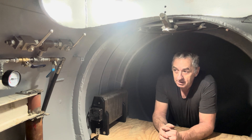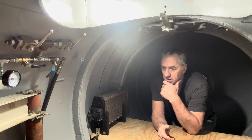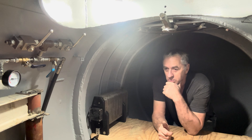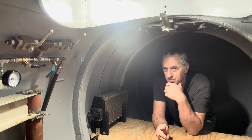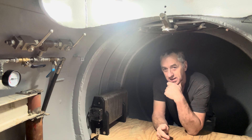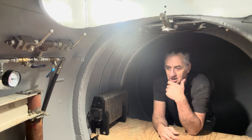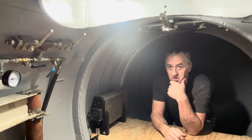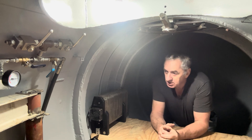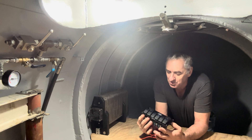So that's the air system — triple redundancy, which is pretty good. And let's say the scuba tank, compressor, and holding tanks all failed — I can still drop my drop weight. That's four systems. Plus a fifth: I can pump all the water out of the variable ballast tank. So there are five systems to bring this thing to the surface.